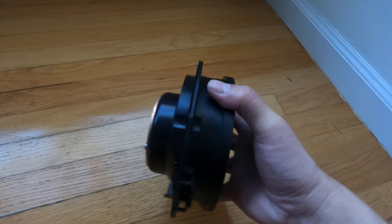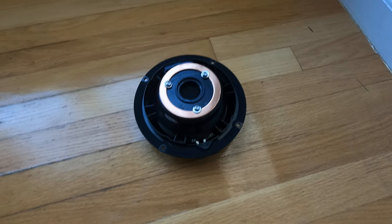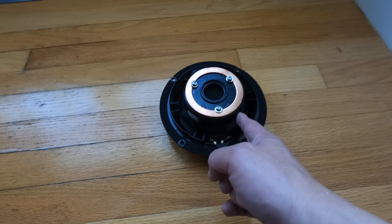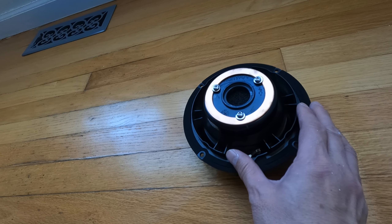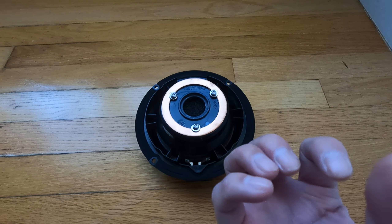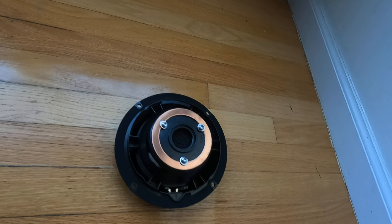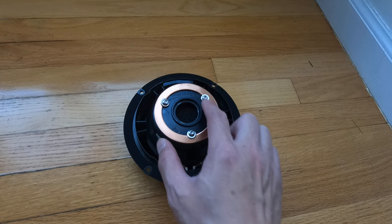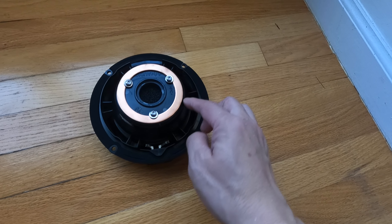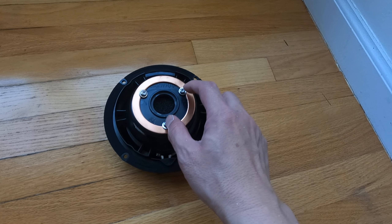There's a problem with these woofers — let's flip it over. You can see it says Dynaudio. The problem is the design: they have a plastic molded frame, however the internal structure — the steel and magnet — is metal. The thermal expansion coefficients are different between the plastic and the metal, which causes a lot of cracks on the housing. You can still see some hairline cracks here and there, mostly occurring where the screws are located — a very highly stressed area.